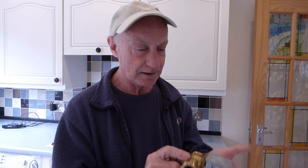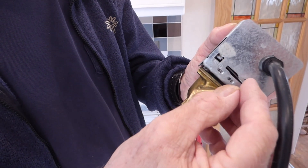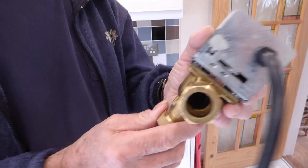When you refill, leave it still in manual mode and it will refill a lot easier. Once it's complete, you can just pull this lever back, drop it back down, and let it drop back to automatic mode when it's all full up and all the air is out of your system. It does help quite a lot if you do that rather than leave it locked off on the auto mode.